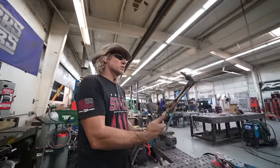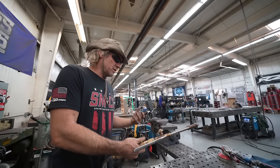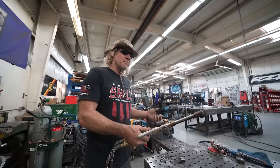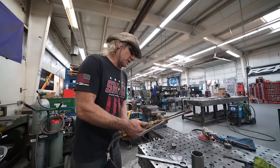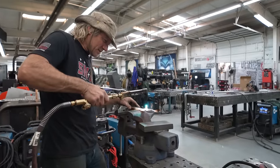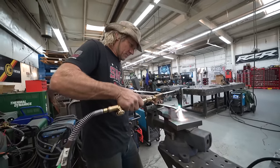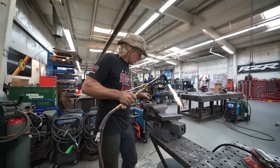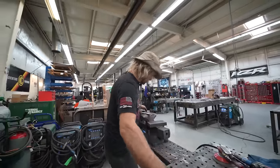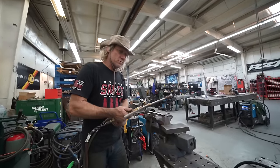Yeah, because normally on the forging of the tool steel, when they get the tempers and stuff, they first do a heat process to relieve any stress that's in it, then you heat it up and then it's quenched, and then it's usually heated up in the furnace at a specific temperature depending on the metal for an hour or two at a time, but I don't have hours. It's probably almost impossible to see in the camera, but there's a slight blue. That went a little bit over. Is it bad if you go over? Well, you really want to be at a specific temperature for a short period of time. You're trying to get it at a specific temperature for the crystals to grow.